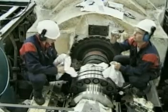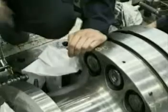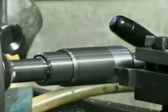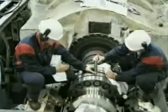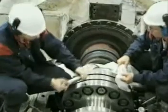The bolt parts and the bolt hole must be thoroughly cleaned before fitting the bolts. The coupling hole bore is measured and as the sleeves are supplied 4% oversize on nominal diameter, they are simply machined to suit. The sleeve is fitted onto the bolt shank and the resultant assembly is easily fitted into the bore in the clearance condition.